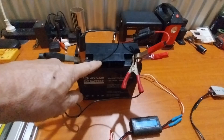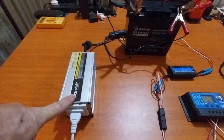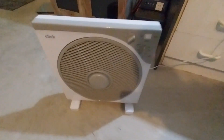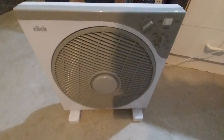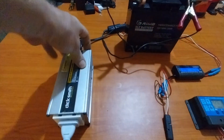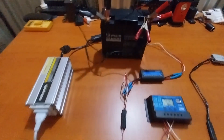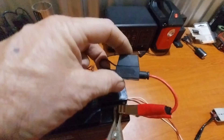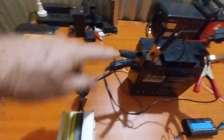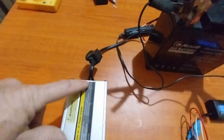From our battery we run our power through to our inverter, which steps our DC power up to AC power. If we turn this on, you can see down here we have a fan running — that's running off our mains power, giving us grid power. We've also got some protection: a fuse from the solar controller to the battery, and fusing from our battery to our inverter, which is internally inside the inverter.